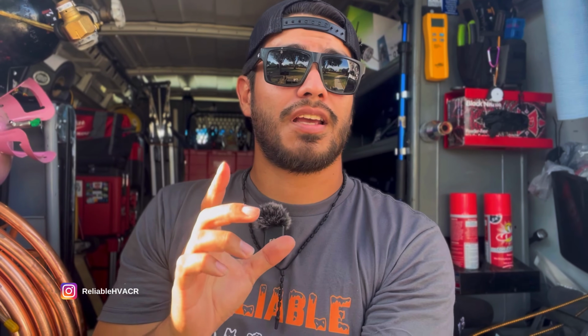All right guys, so now after all that, would I recommend this product? So yes and no. The answer is going to be yes and no. As pressure gauges and temperature clamps, they work perfectly fine. You saw me do superheat and subcool, check pressures really quick just by hooking up and getting the display to give me the pressure. I didn't need a phone or anything like that for most of it, just to quickly check something. So I love that part.